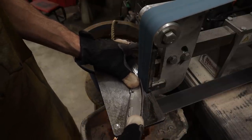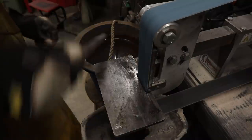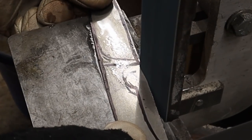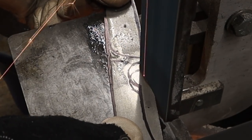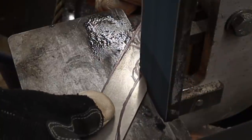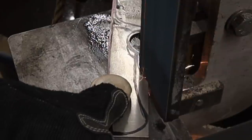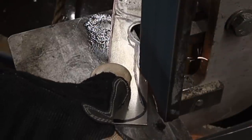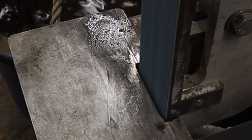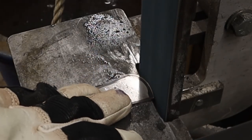It really does work super slick — you guys should try that. Implement it in your own shop and you'll find profiling knives goes super fast. Now watch how I do the finger choil area here. I come in, take the deep bite, and follow the edge of the platen right down into the finger hole area. Then I dip back out because this has a slightly different profile. I take a secondary bite, go as deep as I want to, and now I drag it the full length of that inside curve. When I'm done I'll pull it out, shape the butt of the knife, and we'll have another knife ready to go.